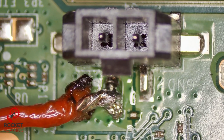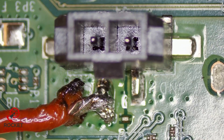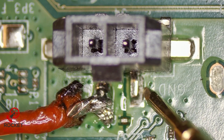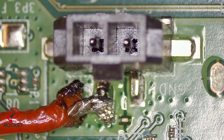This is the power connector for the 12 volt line on that top board. If I take my multimeter, which is in continuity mode, I place one probe on ground — this is the positive pin. You can hear the beep. Same with this one. This pin here is ground, this one on the right. So that's ground. This one on the left is the positive 12 volt in, and this is shorted to ground.